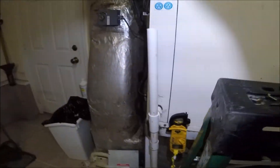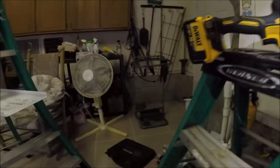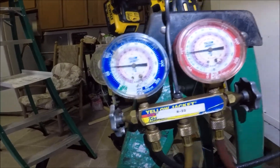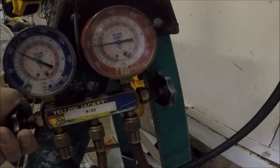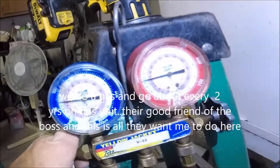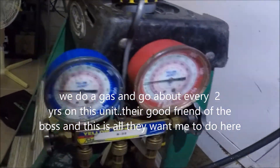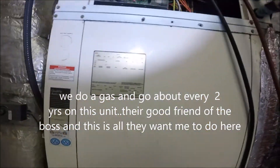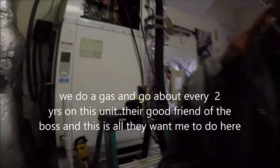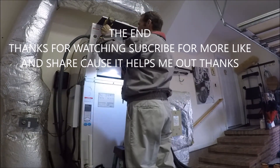We are running on first stage. We've got 88 degrees leaving the unit and it's about 73 in the house. I'm probably not going to put too much more gas in there — that's creeping up to three pounds. We've got two pounds and 11 ounces, and it all looks good. I'm going to button this thing up, get out of here, and go do a startup.